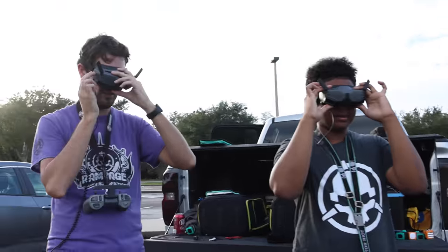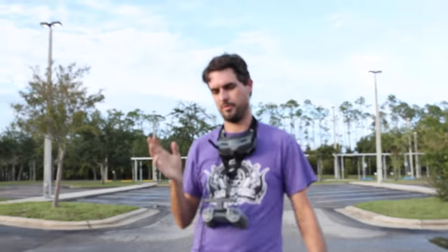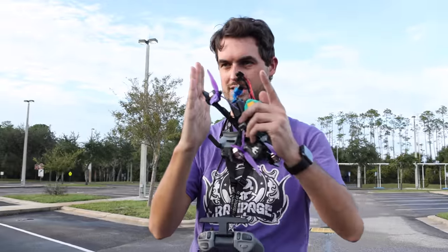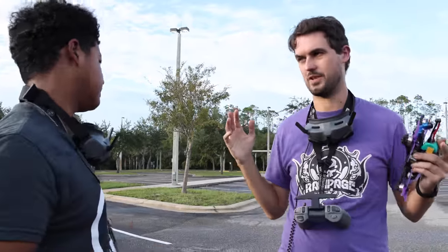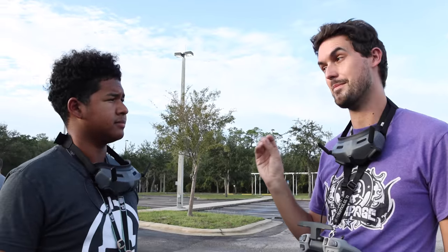Yeah, want to try that? So what does the hertz mean? Is that better image quality? That bandwidth setting is how much of the band you're using. There's the 5.8 gigahertz band, and the bandwidth is literally what hump of the spectrum you're taking over. Higher bandwidth is going to allow you a higher bit rate. I noticed when we were at the 40 megahertz bandwidth setting, I was getting 50 megabits per second.